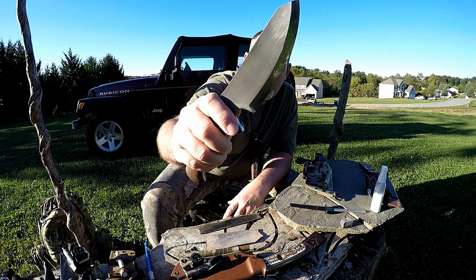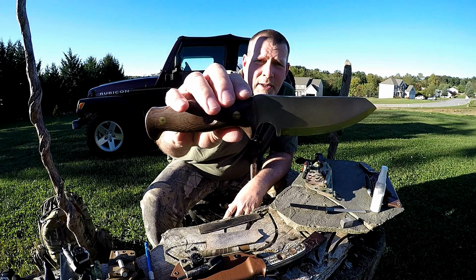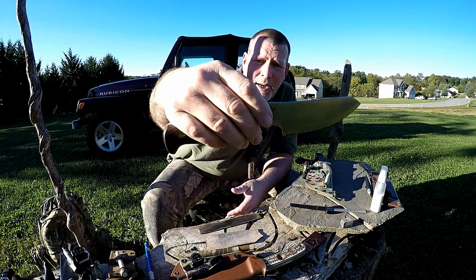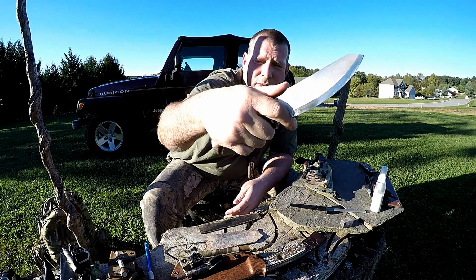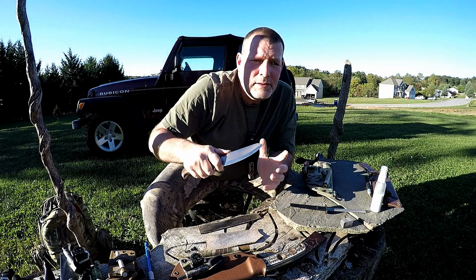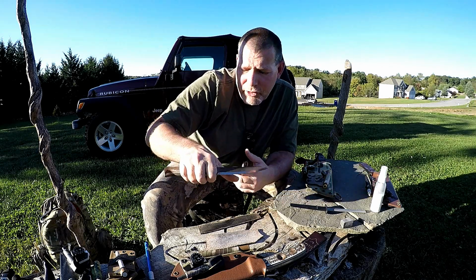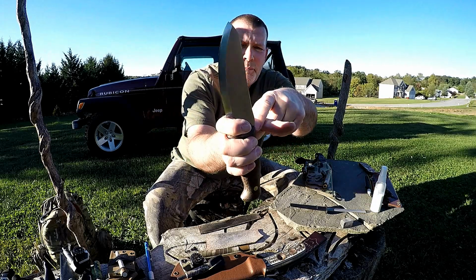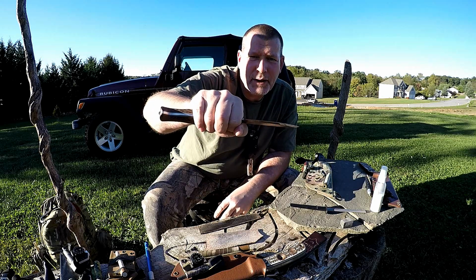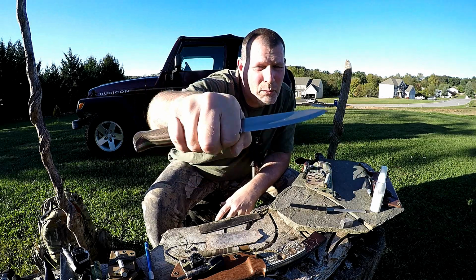It's going to have thumb scallops. It does have a ramp there. The ramp is there for a specific reason for thumb pushes. The top of that ramp fits in that joint of the thumb and gives you better leverage. That's the best way to describe it. If you want even more leverage, you choke up all the way and put your web on the other side of that, and it fits right in there. That's why I designed it that way.